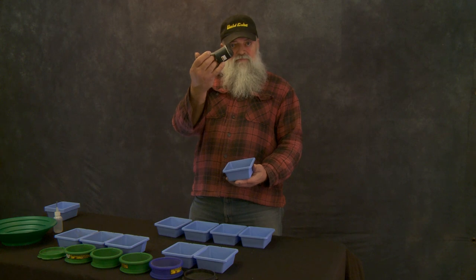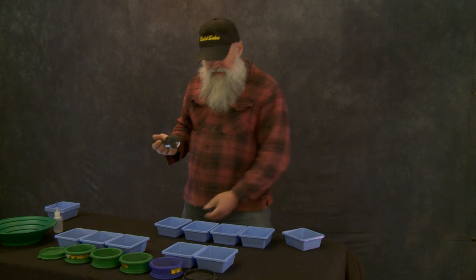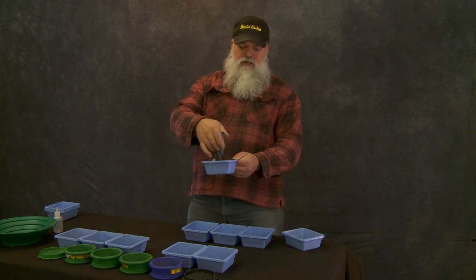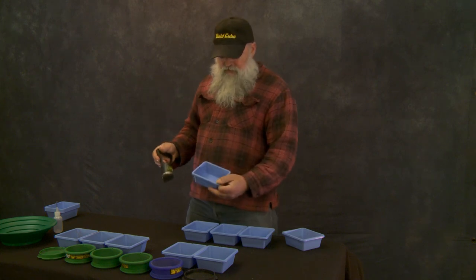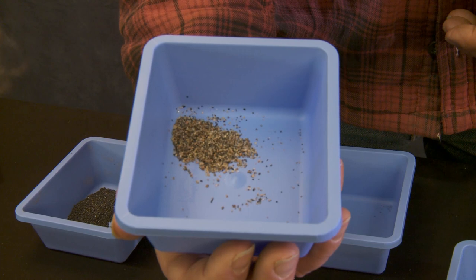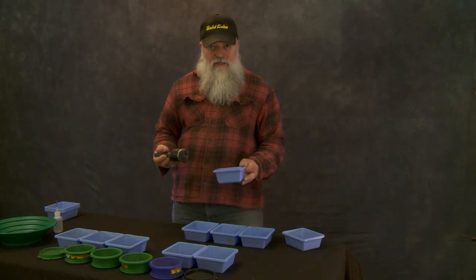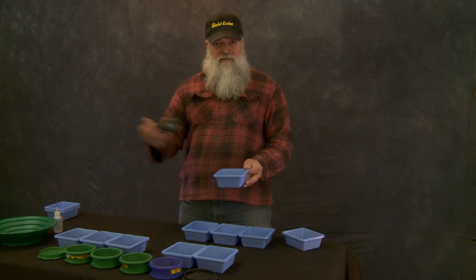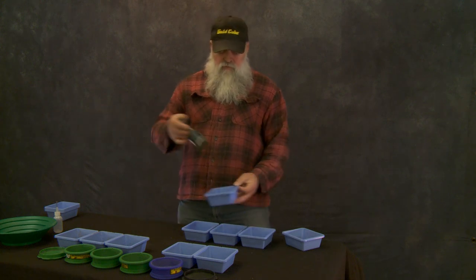When I pick this up, there's more than just magnetics in this material. Let me demonstrate — I'm gonna drop it into a pan, shake it around a little bit, and then pick up the rest of that black sand. If you take a look, there's a lot more material in there than what was black sand. Some of this can be gold — in fact, I can see gold in there. We would have lost gold if we'd just put this black sand in our trash bucket.